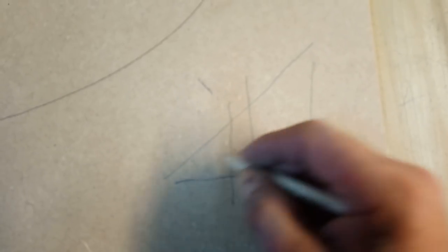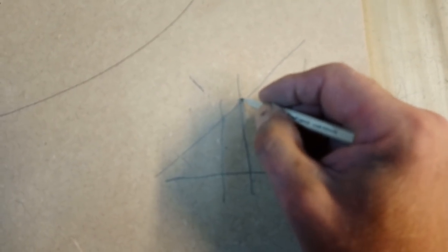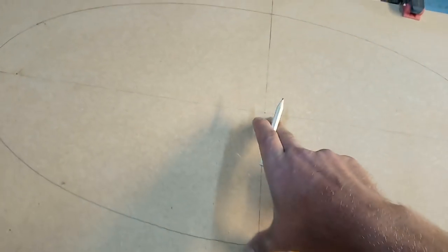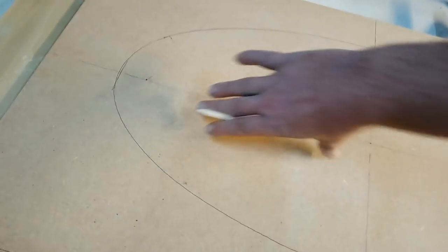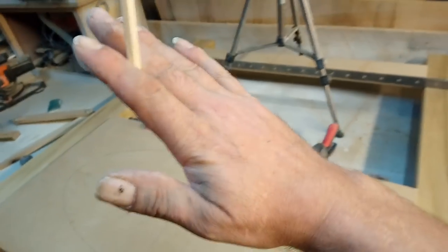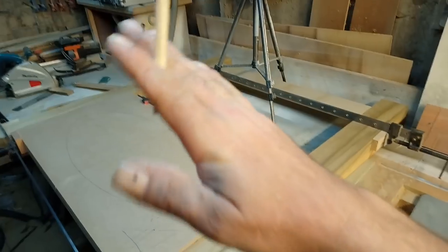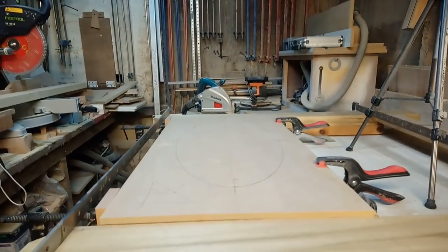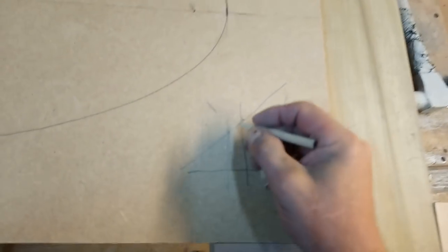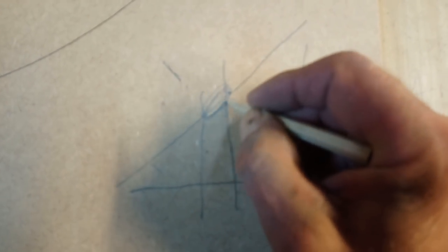So if you can work out from your pitch what that distance is there, that is that full distance. If you know that distance, then the width will be the width of your pipe. So you can work out that distance, mark it out like this, use your radiuses, that one, then that one. Cut out this shape, and then when it's on a slope, on pitch, it could be a bit of slider pipe straight through it. So at an angle, that's like an oval like that.